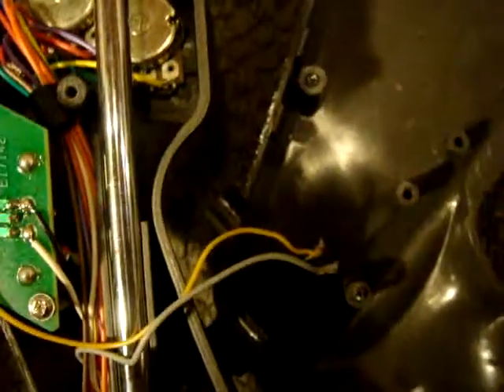That's how simple it is. Now when you add the little switch, remember the switch is a momentary switch — not an on-off. Power is not going to that circuit board until the button is pressed, not the other way around. The good thing about that button is as soon as you take your finger off, power is removed, so there's no chance of you accidentally triggering the easy start or stopping the engine. So it re-centers — that's the beauty of the setup.